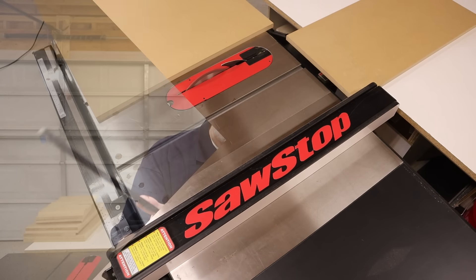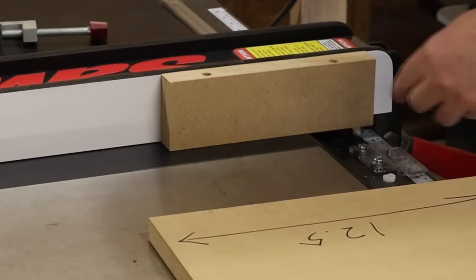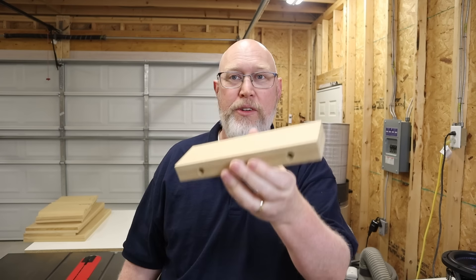Here's a little safety tip for you. If you ever need to use your miter gauge to make a cross cut, you don't want your wood on the miter gauge and on the table saw fence at the exact same time. That means you can't use the measuring tape on the table saw to make an accurate cut. Easy fix — just make a piece like this. It's two pieces of half-inch MDF sandwiched together with some holes drilled in them. Clamp that sucker down to the fence and you can make a safe cut.